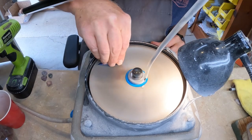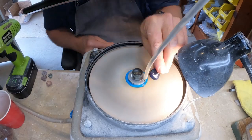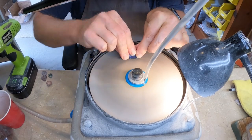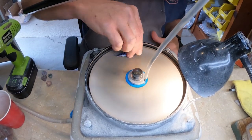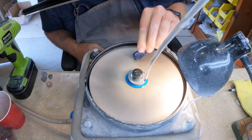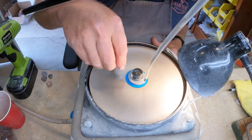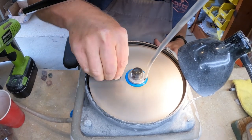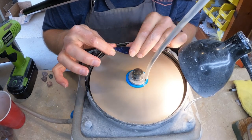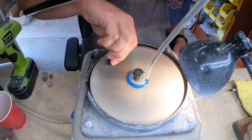As the water and material washes off the disc out to the edge from centrifugal force, it goes into a waste tube which you see exiting the machine on the left-hand side, and it goes down into a waste bucket. I generally don't have a problem with dust until after things that have splattered dry — then there's a film or dust everywhere. It's just grinding rocks; no matter what you do it's going to splatter and make a mess.